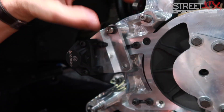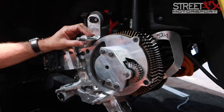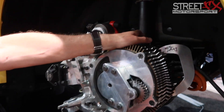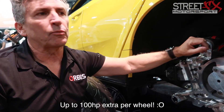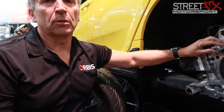Even with this tiny caliper the braking performance is so much improved over factory, just because of the diameter, that you have to have a proportioning valve to dial back the pressure significantly. The wheel is engineered for 100 horsepower per wheel, but in this application — due to the shock tower placement — the largest we can fit is 50 horsepower. These cars are already around 300 horsepower, so you now have a 400-horsepower car. We have twice the battery capacity of a Toyota Prius, so you've got 400 horsepower with Prius-level fuel economy and you can drive 40 miles pure electric.